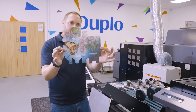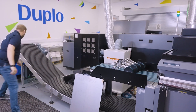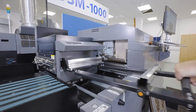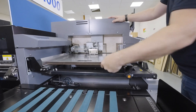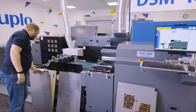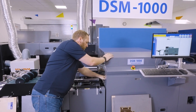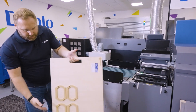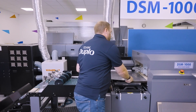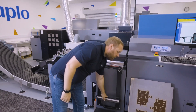As you can see — a nice die-cut carton. Now I'll change over to a kiss cut sticker. We don't need our waste conveyor for this one, so we'll flick that off and adjust our delivery table. We insert our new die — move our separators back, lift up our latch, remove our die, and take out our creasing counter plate. Because we're kiss cutting we won't be creasing the job, so we put in a blank counter plate. That goes in first onto our locator pin, then we get our die — a four-up sticker die goes in with the top plate on top.